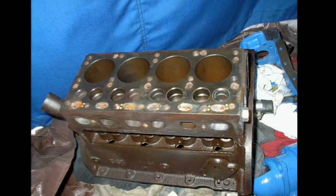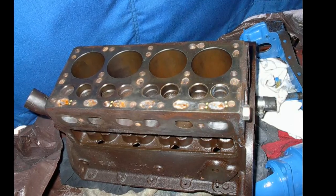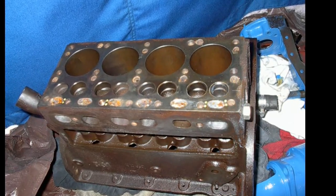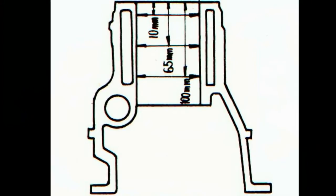These pictures show you where the cooling passages are so you can go drill them out. The only thing I found that got through 30 years of crusty buildup was a drill. Scraping with a screwdriver made it look like shiny metal underneath, where it was actually corrosion.